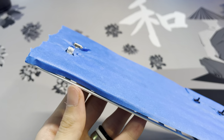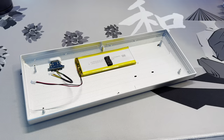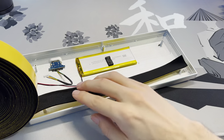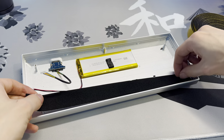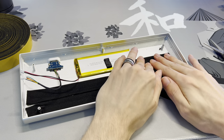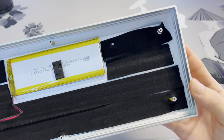At the end, your PCB should look like this with the switches and ports protruding from the tape. Next we're going to take the case and add some foam to it for better acoustics and to make it less hollow. Roll out the foam to about the measurement of the bottom of the case, cut it to size, take the backing off the sticky part, and place it in the bottom of the case. Make cutouts for the standoffs and work around things like the battery and the USB-C port.